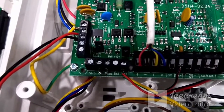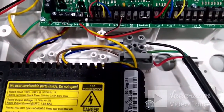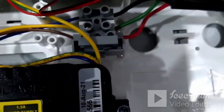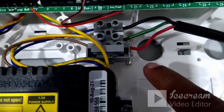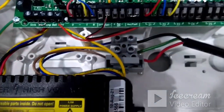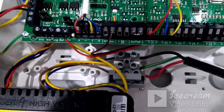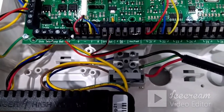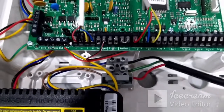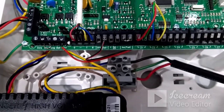The next connection is powering up this panel. To power it up you need a power card connected here — three pins are available: phase, earth, and neutral. This is the third pin connection. For a new installation, first connect the keypad with the panel, then give a 230-volt input to the panel, switch it on, and check if the panel display boots normally.